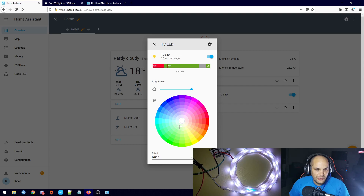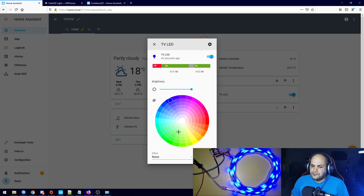If you see inconsistent colors, what can happen — especially with a very long strip — is you may not be supplying enough power. With 5 volts over a long distance you get voltage drop, so at the end of the strip colors may look different than at the beginning. If you run into that, I'd recommend feeding power from both sides: connect 5 volts to both ends of the strip, and that should solve any inconsistent color issues across your LEDs.